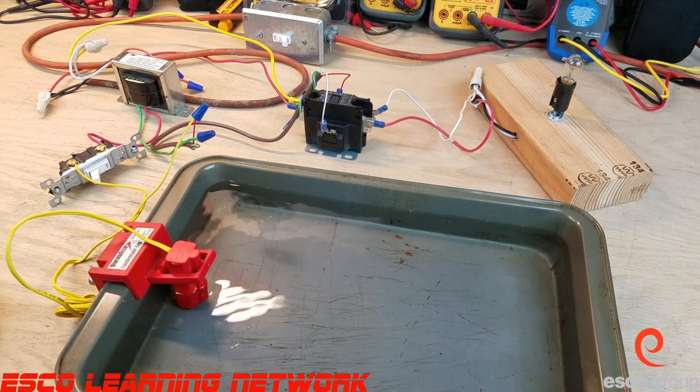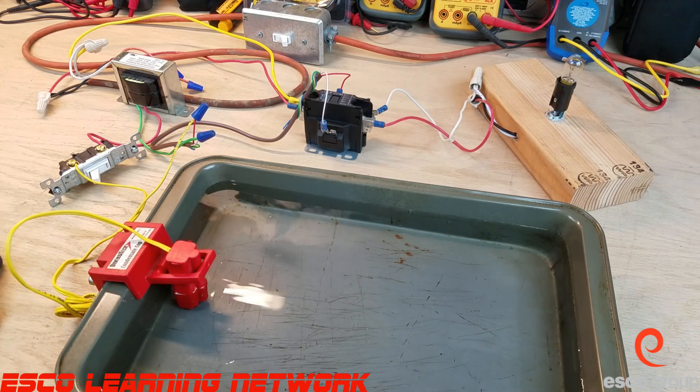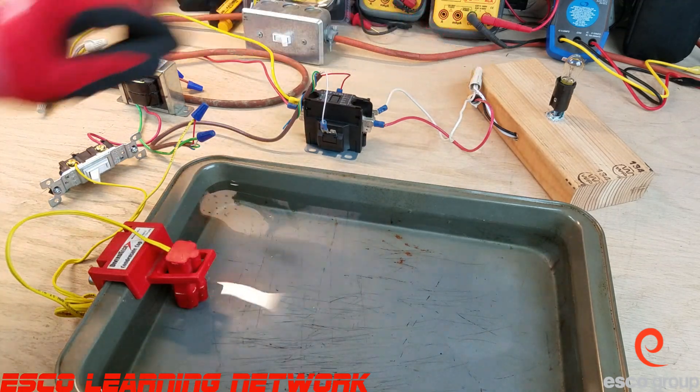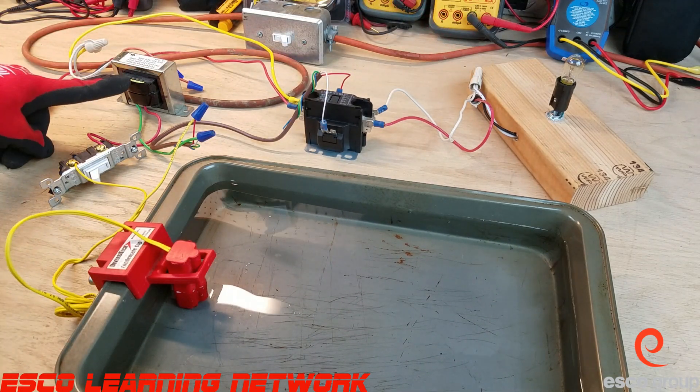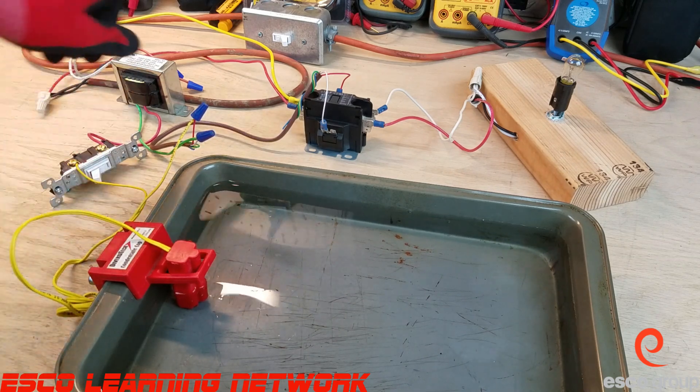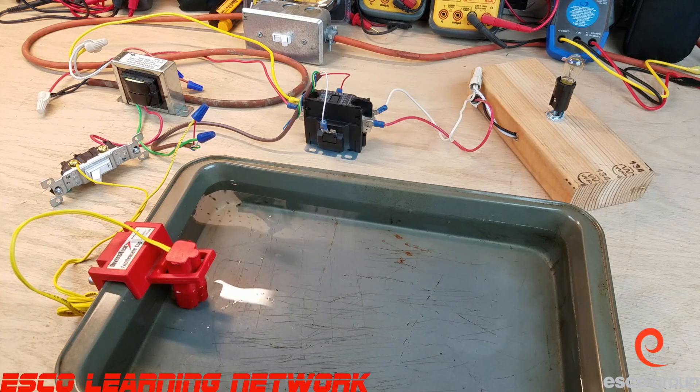There are a lot of different styles of these switches — this is just the particular model I happen to have. Again: line voltage through the contactor to our heat pump or air conditioner, low voltage through this switch in series — float switch, coil of the contactor. I hope you enjoyed this little lab exercise. This has been the workbench. Thank you for joining me and I will see you on the next one.